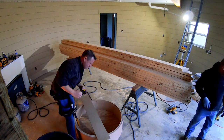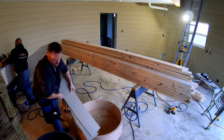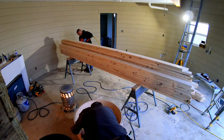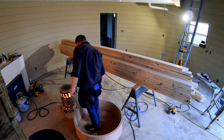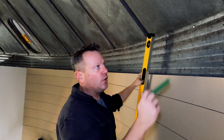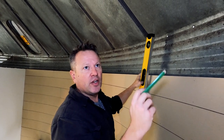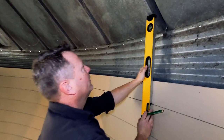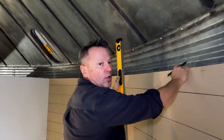I'm laying out my round hub. I found the perfect center of it in both directions, kind of like a cross, so I've got two centers marked on opposing sides. When I go to set my rafters, I'm going to set four rafters to the round hub and that will pin it perfectly centered up in the roof. I'm going to lay out all the other rafters now — there are 32 of them, matching the 32 ribs of the existing roof. I'll mark the outside wall by dropping down from the existing ribs using my level, marking the center of each rafter.